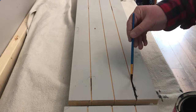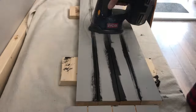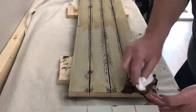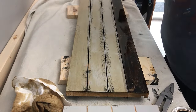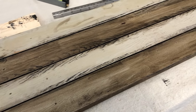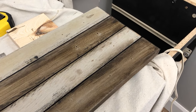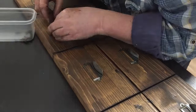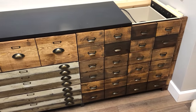The blueprint-style drawers were first painted grey, then the dark stain was added to darken the grooves and any excess was sanded off. The other colors were added more as a paint effect to dirty up the drawers and make them look more aged. I then attached all of the drawer pulls and assembled the drawers. I much prefer the effect of the random shades of stain over a single stain color.